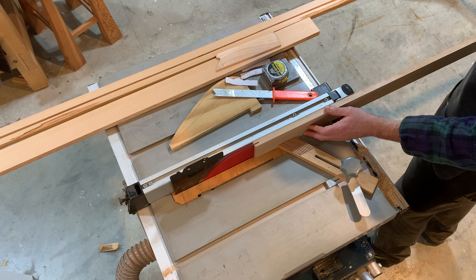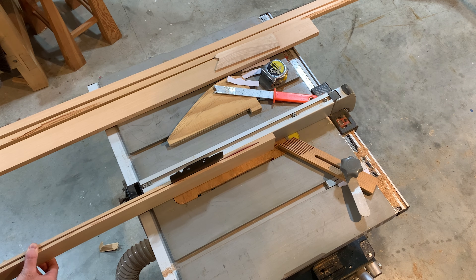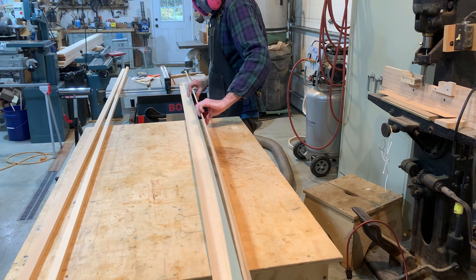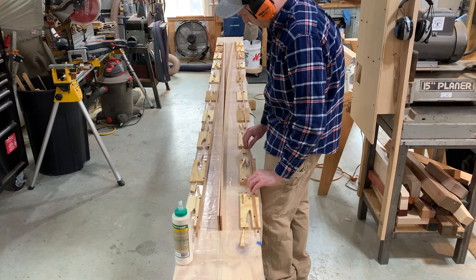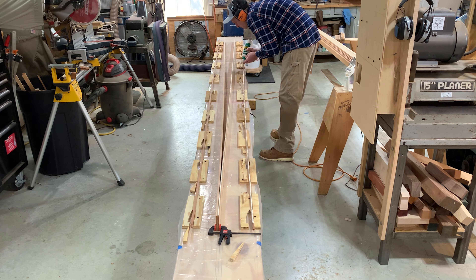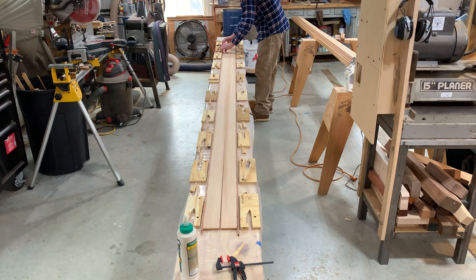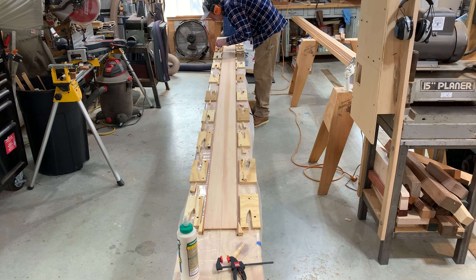I just took that featherboard right back off the bandsaw, put it on to my table saw, and if you have the riving knife installed correctly, it should pretty much hold it right to the fence. So even though these are little skinny quarter-inch strips, it came out perfect. To give myself a fighting chance, I did this in a bunch of glue-ups, because I wanted to put the whole top sheet on at once. I'm going to make a big sheet out of all these pieces of wood for the top, and a big sheet for the bottom — two glue-ups on the board, but that requires a whole bunch of glue-ups ahead of time.